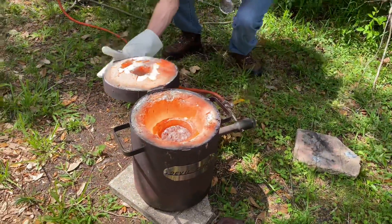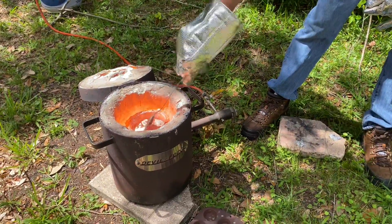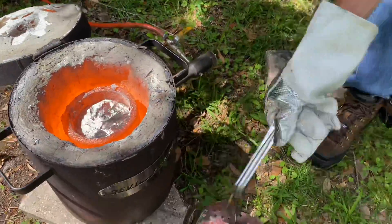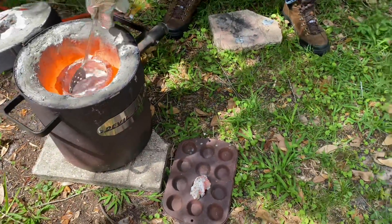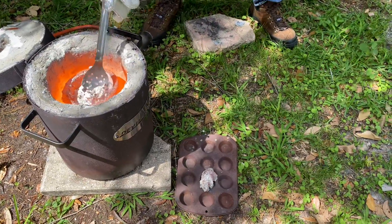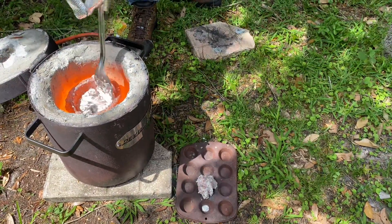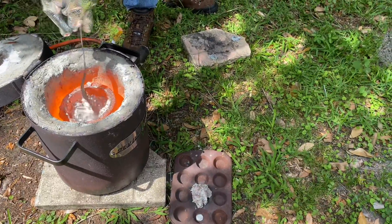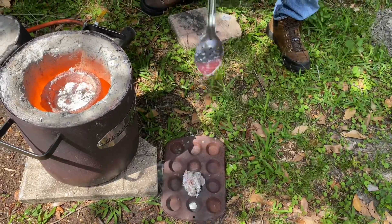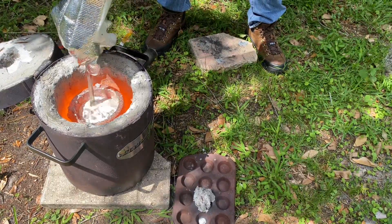All right, so here I'm gonna scoop all this dross off the top. This dross is basically aluminum oxide, oil, and dirt that can't burn — it just flows to the surface since it's lighter than the aluminum. I usually try to remelt this stuff at least once because it does pick up a little bit of good aluminum with it as you bring it out. All right, that's basically all you've got, and I'm gonna get down in the bottom here and knock loose some stuff that might be down there.